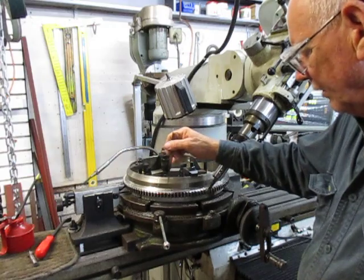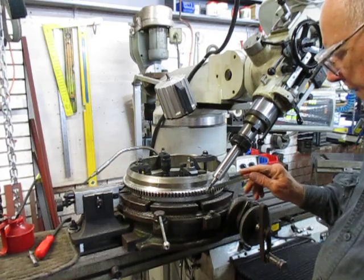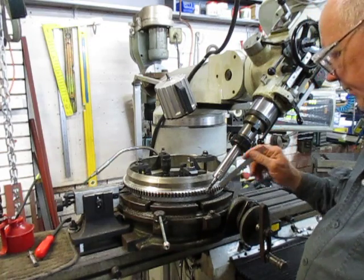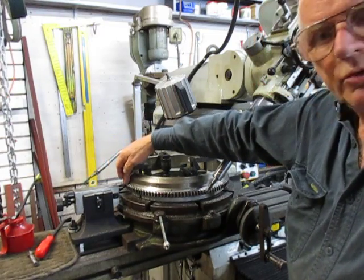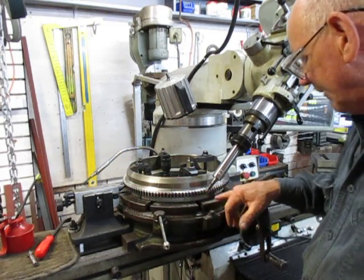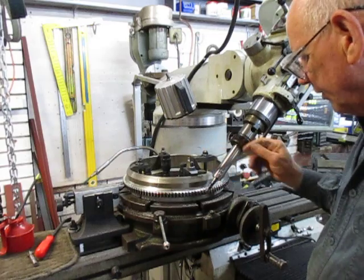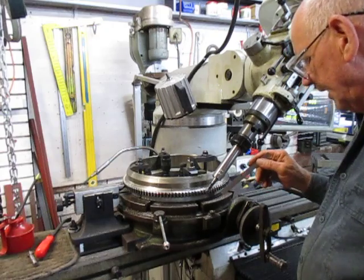Anyway, in just over two hours I've managed to gash the angles of all these using a carbide 12mm cutter, set up in the exact same situation as I had before, using the tailstock to do my indexing. I've got all the way around to these teeth here that have been welded before and a couple beyond.